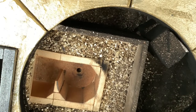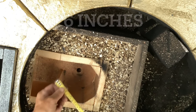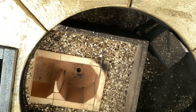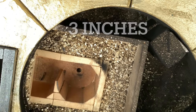Here we are looking into the actual vortex chamber. These measurements are slightly different - it's exactly a six-inch system and we've got exactly six inches across. This piece of vermiculite seems to be lasting very well with no real deterioration. Basically we've got three inches cut off, so 50 percent has been removed to allow the vortex to form.